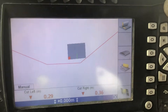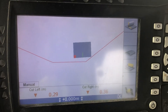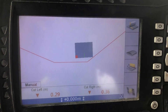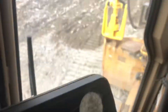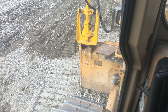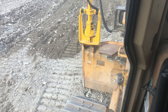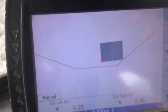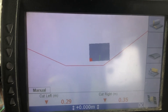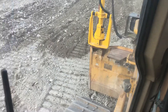A little tip in GCS 900 — just a way of adjusting your cut fill value to match a surveyor. Say the surveyor's put a cut fill on the ground of 320mm, so maybe 0.32m. But the GPS doesn't quite agree with that — it's saying 0.29 on the left tip here rather than 0.32 which is what the surveyor has marked on the ground.